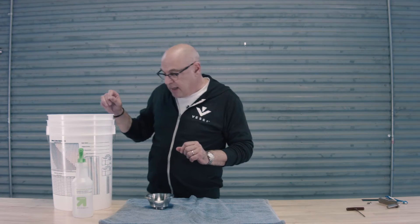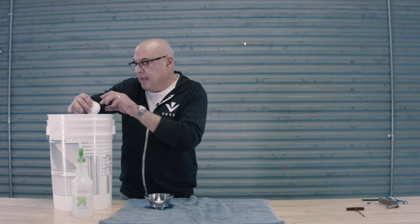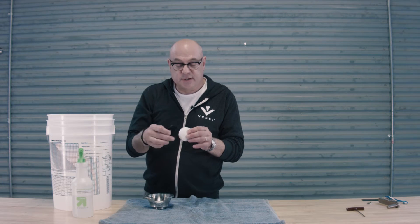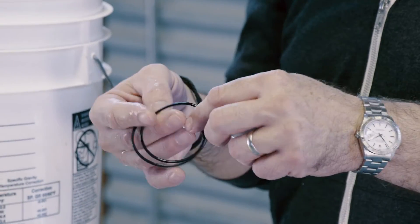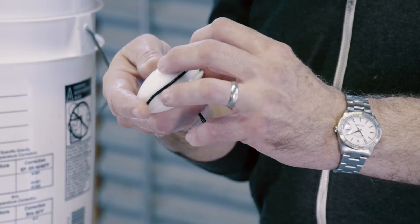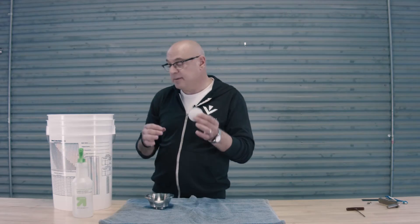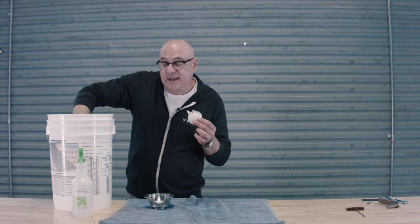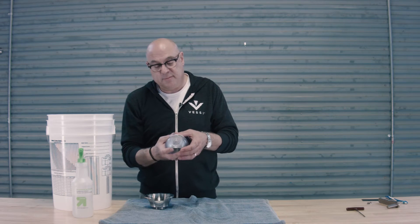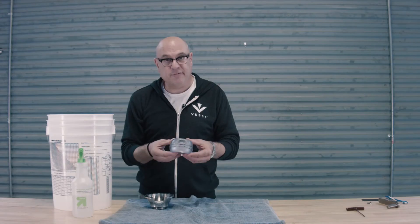Now it's in place. The next thing we're going to do is look for the piston and for the two smaller gaskets that ride onto the grooves on the piston. Taking one gasket at a time, carefully place it inside its groove and stretch it around, then repeat the process with the second groove. The piston is now assembled with its gaskets. Next, we take the clear spherical assembly and put the piston in, pushing it with our thumbs approximately halfway through.